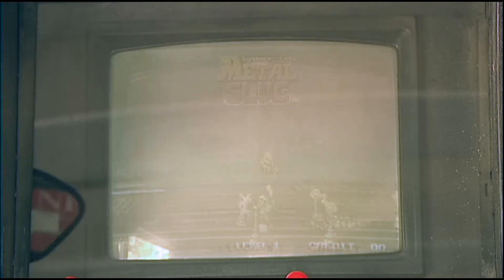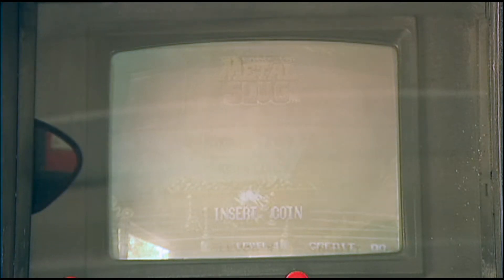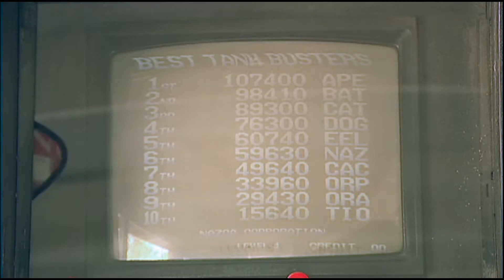I'm going to lower the brightness here and just raise it. See those lines coming in there? Those are retrace lines. Those will come in when your screen control is turned up too high. So you want to adjust it down just to where those disappear.